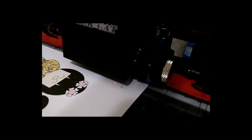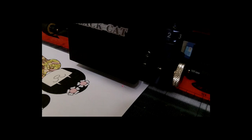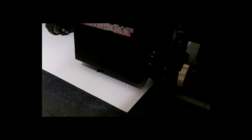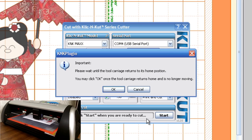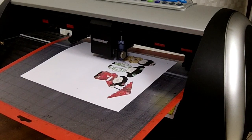When you move the laser over the registration dot, you'll notice that once you're on top of it, the dot will dim. Once you have it right where you want it, right where that dim is, you can hit the Enter button on the keyboard or the origin key displayed on your screen. We're going to do this two more times — it will move to where it thinks the next registration mark is, and you tweak it with the arrow buttons and hit enter. Once you're over that last dot and push enter, Make the Cut will start sending all the data to your machine and it will start cutting.